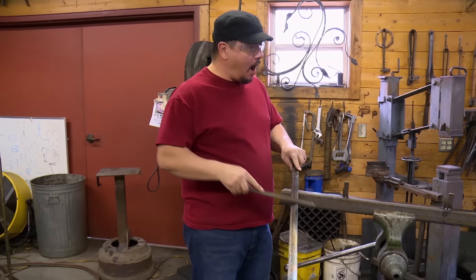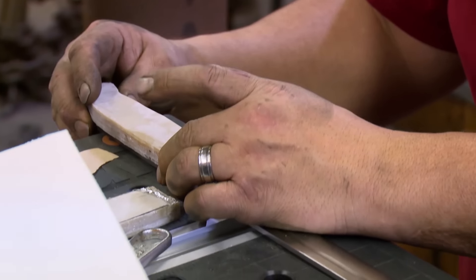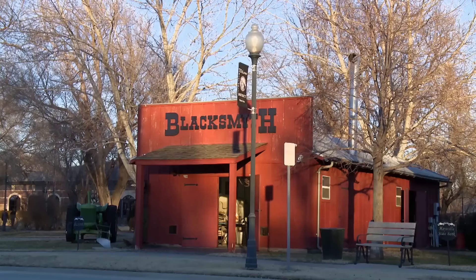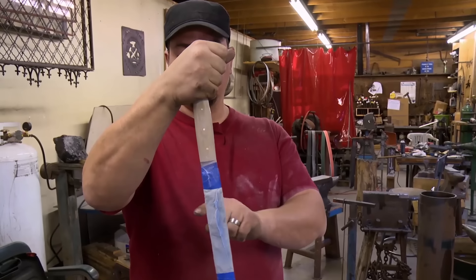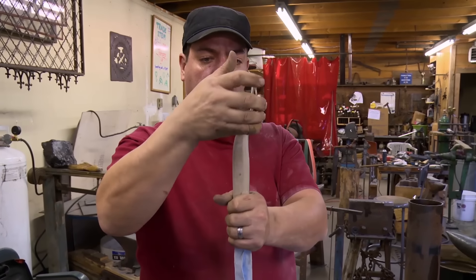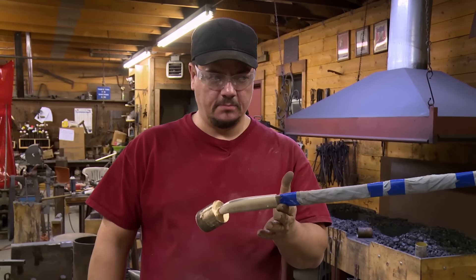Finally got this warp out — still hard. It's time to move on to the handle material. I set up the micarta handles by cutting them to rough shape to fit the handle, then drilled the holes. I need to get the pommel next — when I make the guard a knuckle bow, I need to know where to end it. It's pretty blade heavy, and it's going to need a big chunk of brass to balance that out.